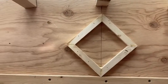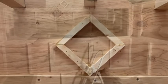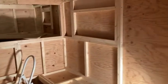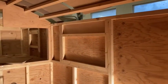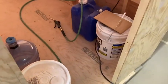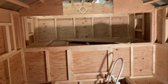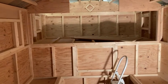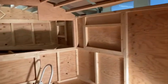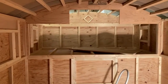It's the last of the rough framed openings — time to drill some holes and route some plywood. I just took a few minutes, emptied the tools out of here; it's about to get pretty dusty. I've got some routing to do with my freshly framed openings. The only thing really left in here is a little bit of weight and that plank for working up there — it was feeling a little tippy, so I threw a bit of weight in here. I'm going to set up the router, drill a couple of starter holes, and let's plunge, baby.